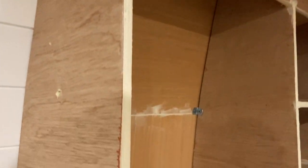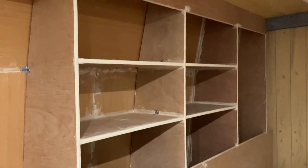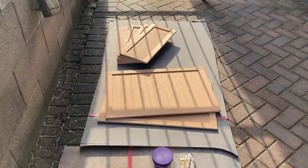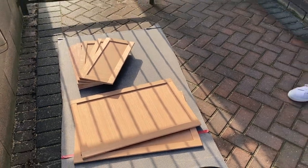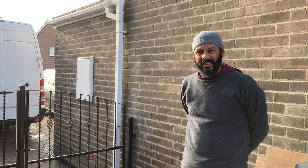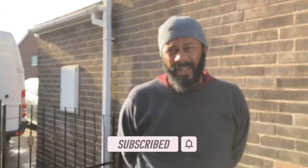Got all that filled — all the edges. It's really important that you do this bit because the paint just soaks into plywood if you don't. That'll harden overnight and then we can sand it tomorrow. Today we've got to get these doors filled and ready to be sanded and painted. It's going to be a dusty day — the dust gets absolutely everywhere — so we're trying something a little bit different: blocking off the section we're sanding from the rest of the van, otherwise we'd be cleaning it for three months.